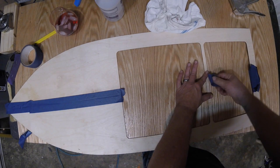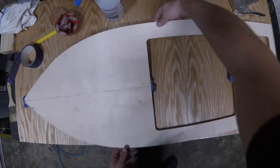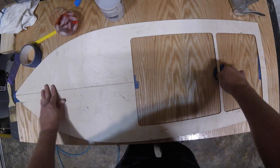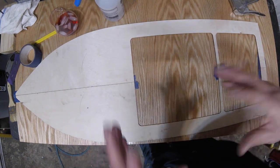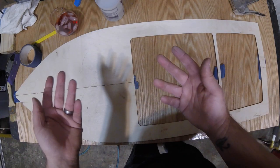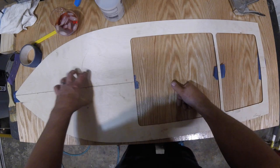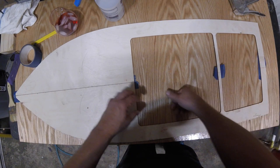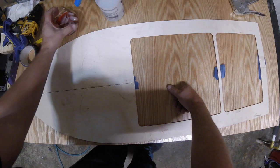So hopefully this sits good. Now, carefully, we're going to flip this over. I am going to weight this down. Now what we're going to do — we've got this little beveled edge and you can see it's not laying flat. When you get a kit, it's very important — if you let it sit in your shop for a while, especially where I live right on the water, it gets humid and it warps. You should always store your spare pieces in a flat spot. This is pretty warped, and it's not the kit's fault, it's my fault. So I'm going to put my epoxy in here and weight it down. I've got my epoxy cooking.